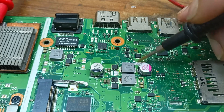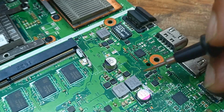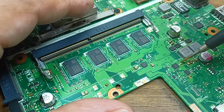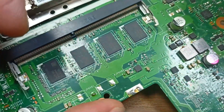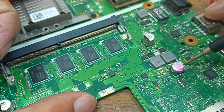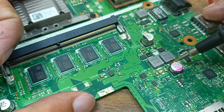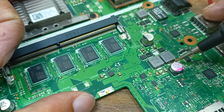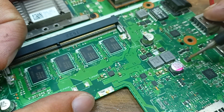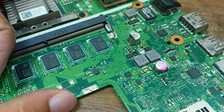I need to find out where this line is going — it's passing through this hole. I also cut this pin from here. This side is open, and you can see here another side is also open, connected by soldering. I remove this solder from here. The 3.3V or 5V shows no short from this side, and the short is coming from this side here. I need a diagram — without a diagram, this is not possible to work on right now.